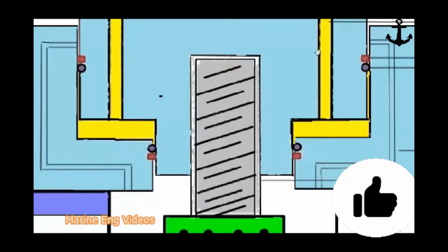Once again, I stress this point. This set of O-rings and backup rings, the sealing rings together, is mounted on the stationary cylinder, and this set of sealing rings is mounted on the moving piston. So these perform the sealing action. The hydraulic oil pressure is equally transmitted and fills this space, and it acts upon the O-ring. You can see these two O-rings over here prevent the oil leakage, and the backup ring supports the O-ring to withstand such a high pressure. So the backup rings are positioned outwards and the O-rings are positioned inwards.